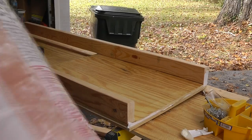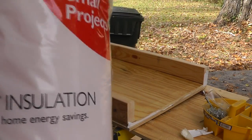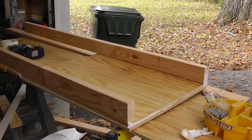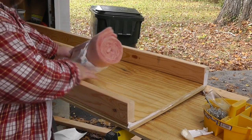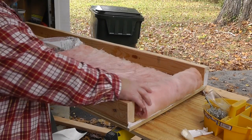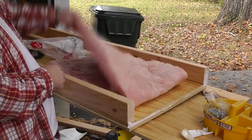This is a roll of two-inch thick, R6.7 insulation — I'm going to double it. A lot of older homes didn't have insulation, or if they did it would have settled because they used old rock wool or something similar. Back in the 30s, 40s, and 50s we didn't have the matted fiberglass insulation we have today.